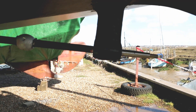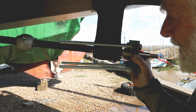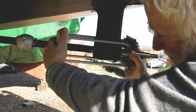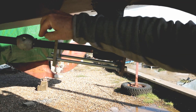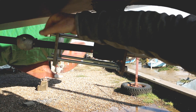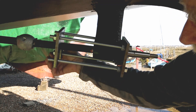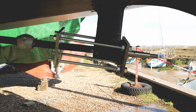Going to show you how this fits together. Just slide this on over the p-bracket and then this slides over like so, push those together, and put your nuts on. In practice we found that you only needed to adjust two diagonal nuts rather than all four, but we had all four on — kept the other two finger tight and moved one half a turn each time.